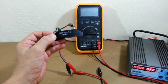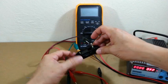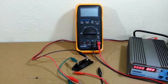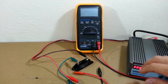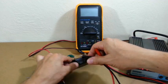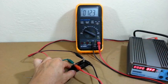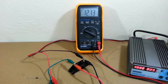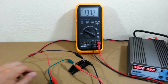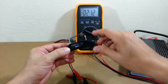Since this is a 20,000V diode, maybe it is built using 20 1000V diodes in series, so the voltage drop will be something around 20 times 0.7V, or around 14V. Let's check. I'm going to pass a current through the diode using a resistor to limit the current and measure the voltage across the diode. Turning on the power supply, we can see that indeed the voltage drop is close to 14V. Therefore, the diode must be built using 20 1000V diodes in series — this is normal for this kind of high voltage diode.